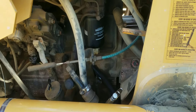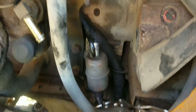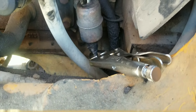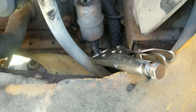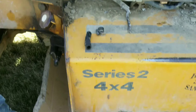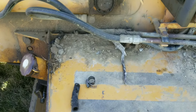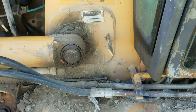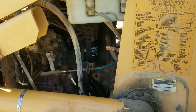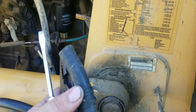Just seeing how deteriorated this hose is, that's the obvious place to start with why this thing's not starting — and the customer said he had to reprime the tractor earlier today. The line's off, the vice grips are pinching the hose, there's no fuel coming out of it — it's probably empty all the way through. The vice grips are also holding the filter up so it doesn't fall. The water and fuel separator was also completely dry, which furthers our theory that this is the problem.